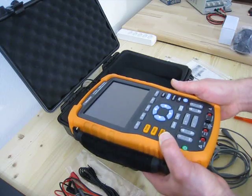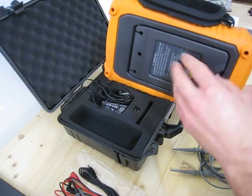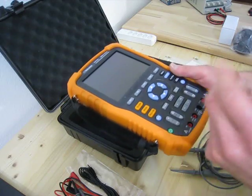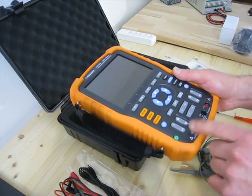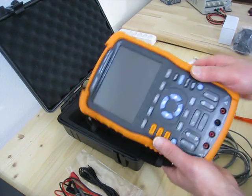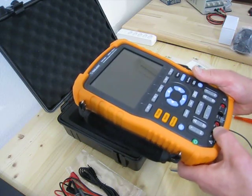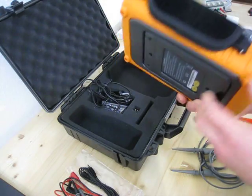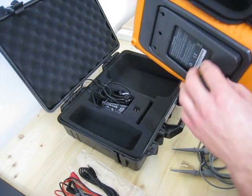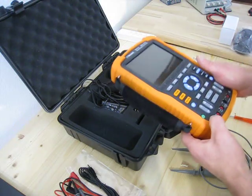I think that's it for the first overview. Everything is mostly fine, just a couple of major issues: the unfused 10A input is really a no-go, and you have to break open the seal just to change the 600mA fuse, which means you lose the warranty. Also, the feet design — just making two holes in the body to keep the feet in there — is a super bad idea.